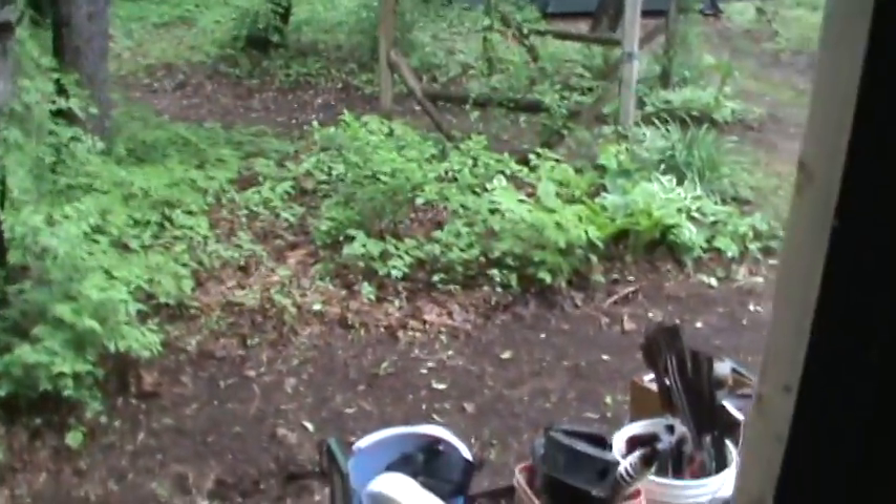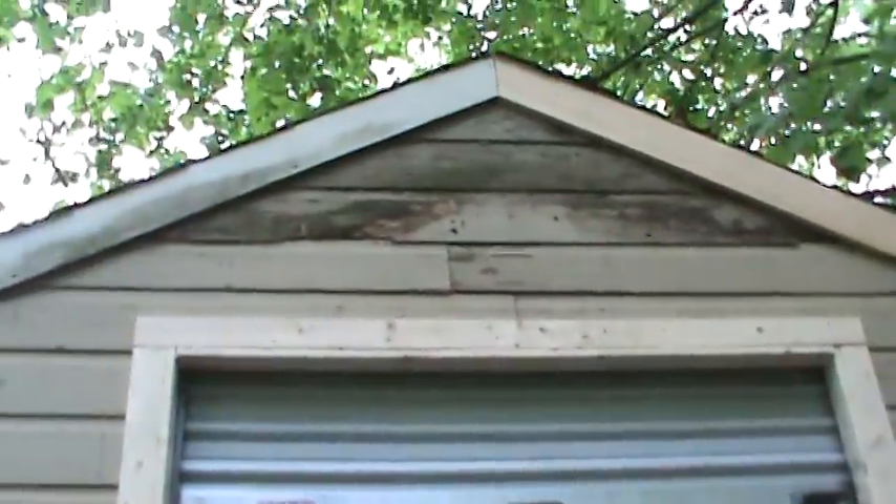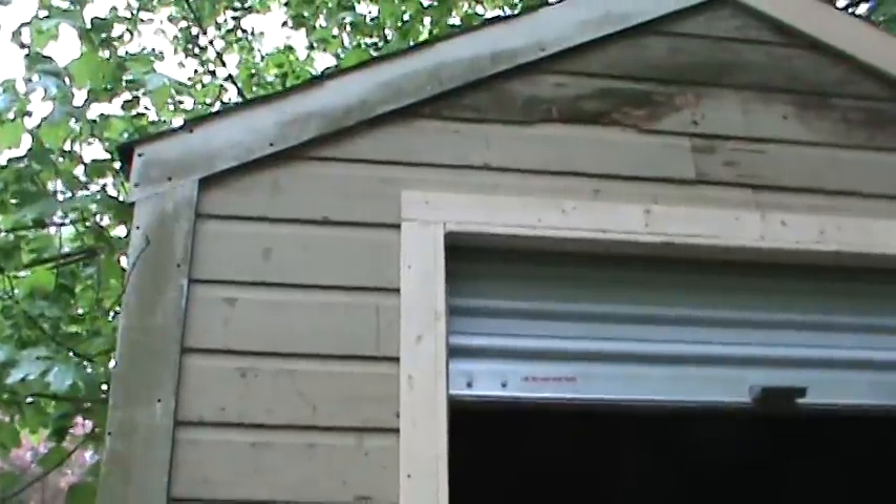And that's the inside of the door — he kind of framed it out and put it back together again. Remember before, all that was rotted out all the way around. Those boards in the center, and again on that side too. I kind of ran out of wood — there's one piece that's a little punky up there, but I'm not going to worry about it too bad. I have four tubes of silicone, I'm just going to run around and caulk all the joints so moisture doesn't get behind those. But she's together, in place, level, sturdy.